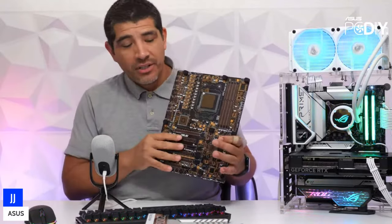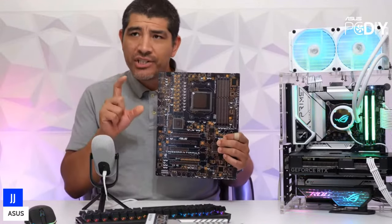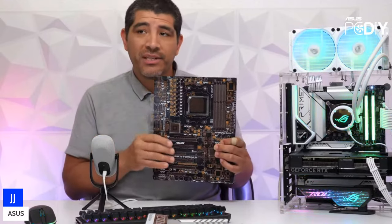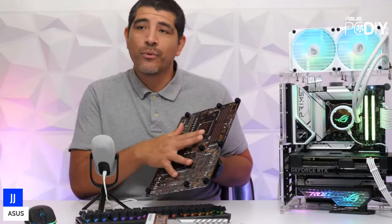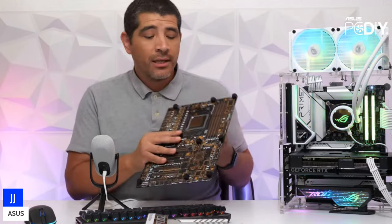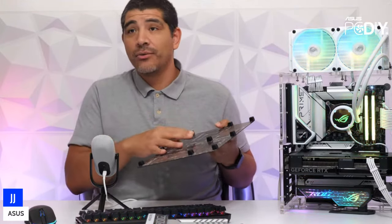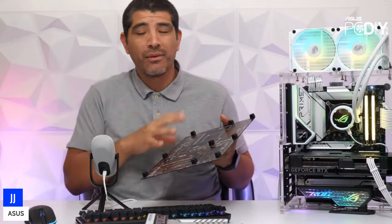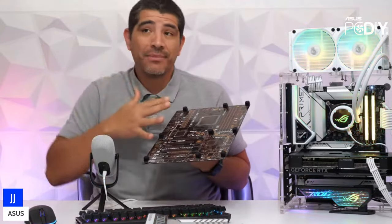On top of that, when we transitioned into the PCIe Gen 4 era, and of course now we have PCIe Gen 5, the stringency of signal integrity is significantly more challenging than with prior generations of PCI Express. Now, why does that matter? Because that means there are more advanced PCB production requirements applied to the motherboard. You might introduce new types of PCB designs called mid-loss or low-loss PCBs. These weren't previously utilized, or they might have been used for specialized, very high-end products, like servers or workstations, or mini ITX-based boards, or some of our enthusiast-based motherboards. But now you're even seeing this come down into the entry segment.